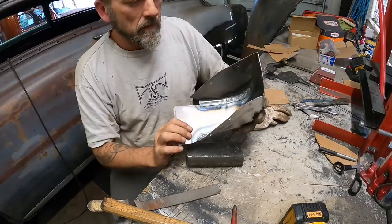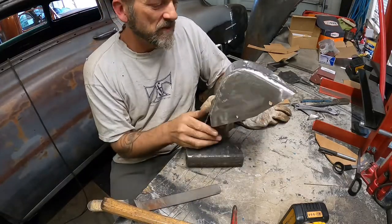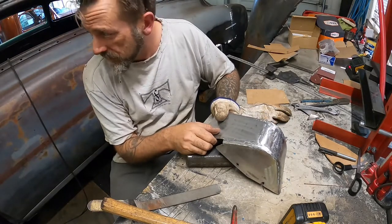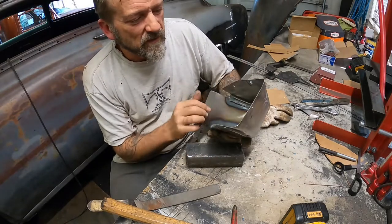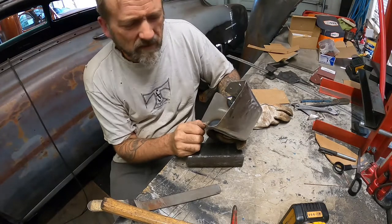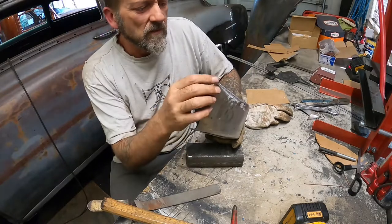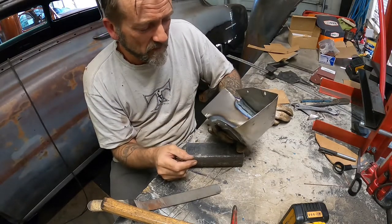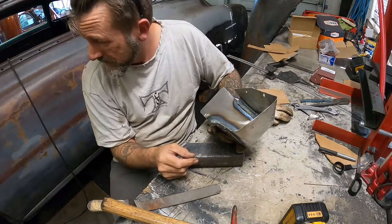Alrighty. Oh, I'm pretty happy with that, as far as a nice sort of metal finish. I hardly ever try and get a file finish on stuff. It's only really if I'm doing it on the bench that you can do that. When you're working on rust repairs and cutting patches out of cars and you can't get back in behind it, it gets a little bit trickier. Not entirely impossible, because I've seen people do it and they just got more patience than me.